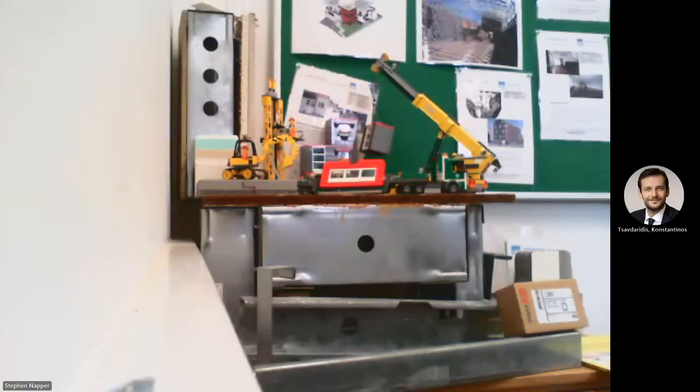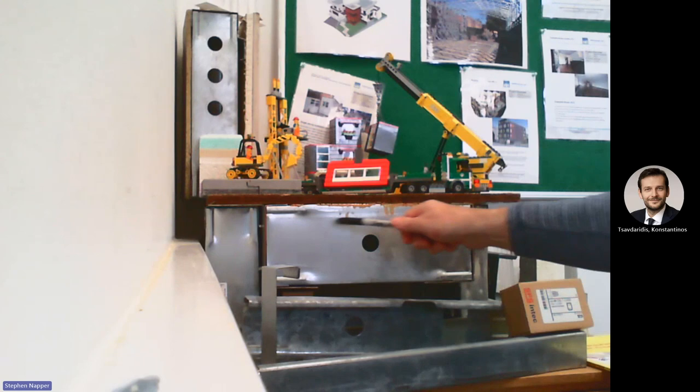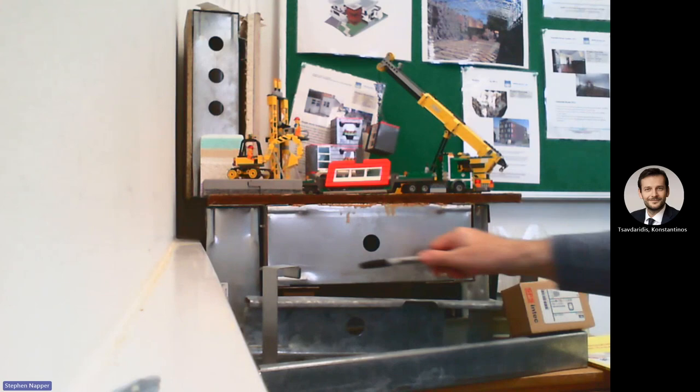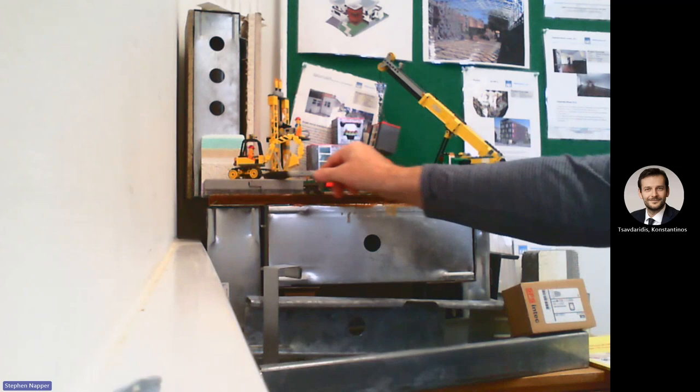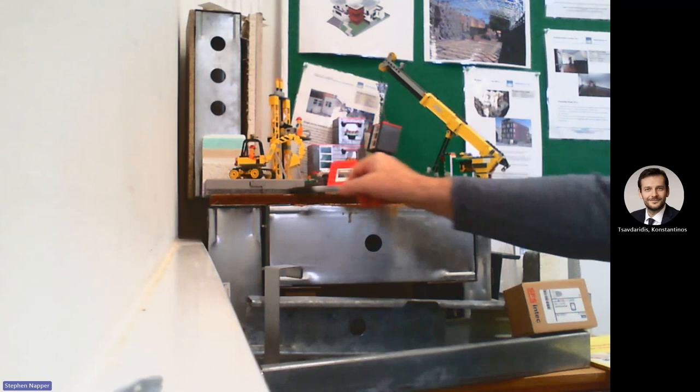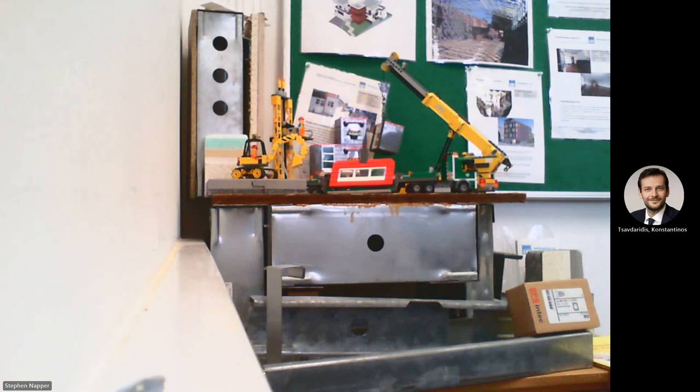You'll be able to see that we have floor joists on something called the zed hanger, so it sits on top of the wall stud and comes out underneath. We've got a floor board finish, a simple OSB, and we also have an example of the cementitious board with a fleece — literally like the fleece you might wear as a coat lining — and this gives a particularly robust and very good acoustically and thermally defined floor construction.